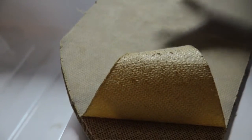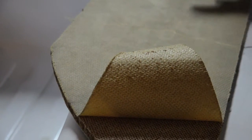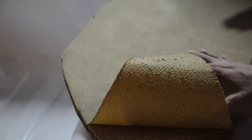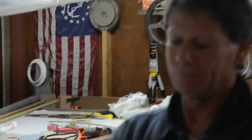Even with this, Kevlar is terrible because it doesn't absorb resin. It's surrounded by resin, so you're relying on the resin for everything. That's why this stuff is always flexible. It does nothing for you. It is a nothing material that somebody keeps tossing at the world. I guess it's good for jackets, or abrasion. You put it on the bottom of the car. Yeah, for jackets.